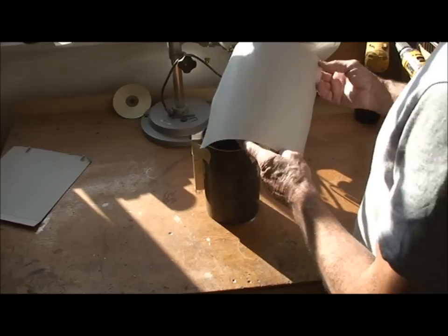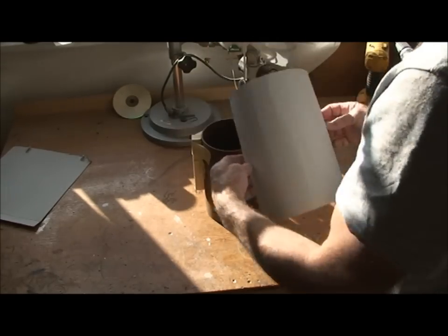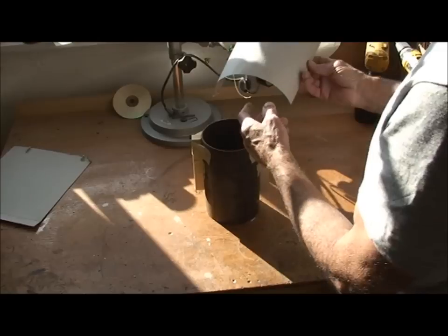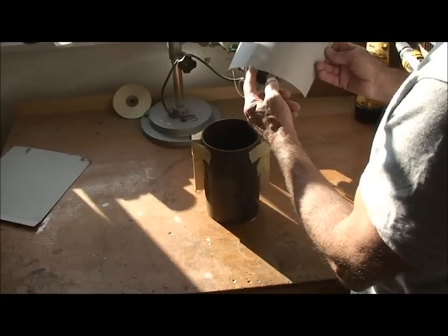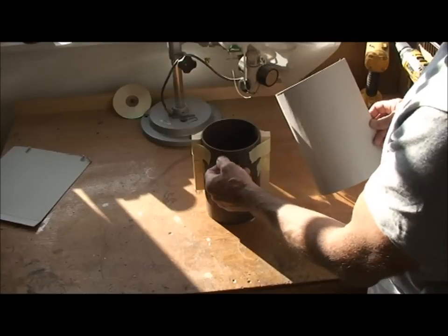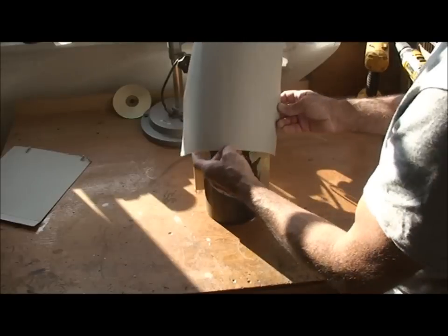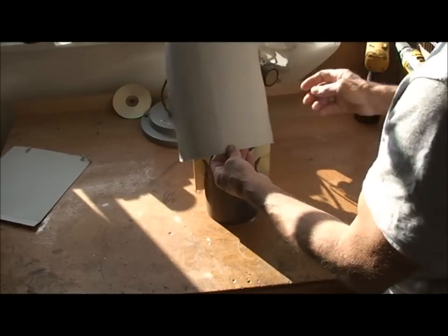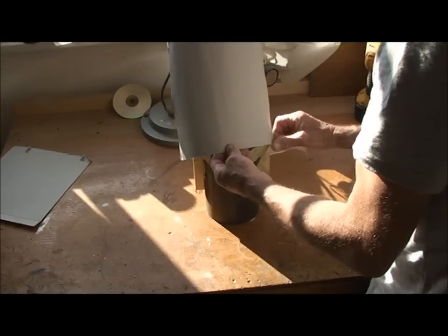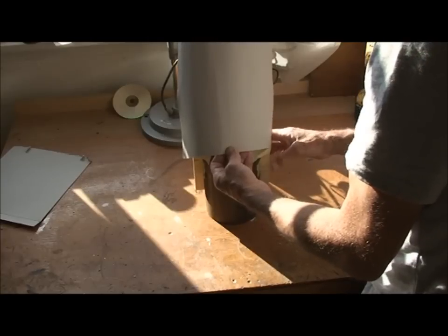You want a piece of card, just bend it into a bit of a curl, and then just stick the card on there temporarily. The bottom of this lip wants to be about half an inch below that edge of the top of the flue pipe. Just drop that down a bit and stick a piece of tape on there, roughly in the centre of that timber.